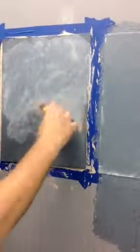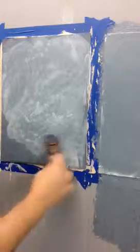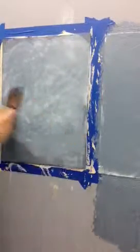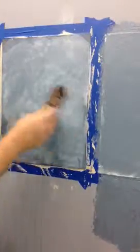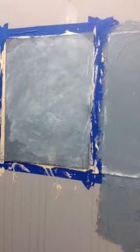You do have to work this corner to corner, but it's a good idea to keep a jagged edge as you go along. You wouldn't want to do straight across because you might get some striping. So you're kind of floating and smoothing, and then the final step is just a scrape. That'll dry probably in a half hour or so, and that's the coarse metallic plaster finish.